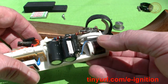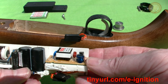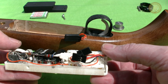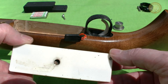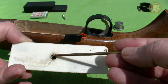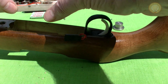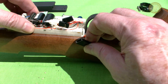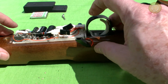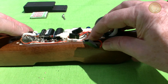The power supply was specially made to ignite smokeless powder, and there is a separate web page showing how it was designed and built. The hot contact in the center accepts the receiver spring contact, and the corner spring provides the ground connection. All these components connect together, with the battery pack held down by two screws.